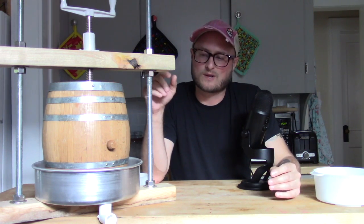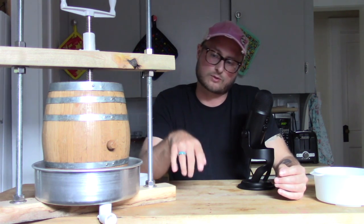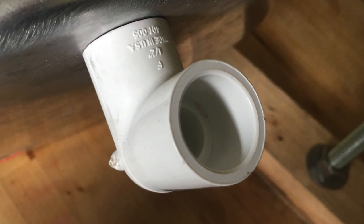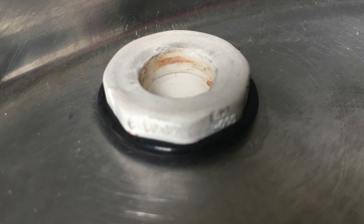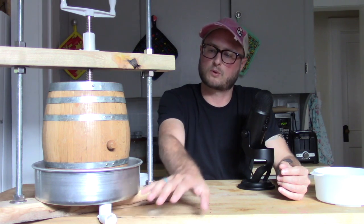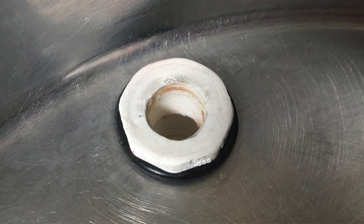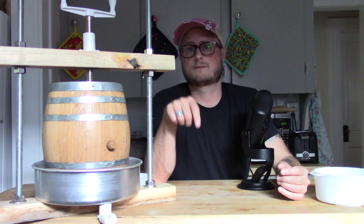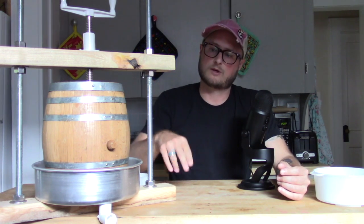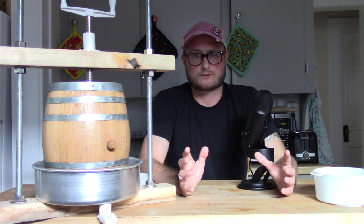With this concept in mind, I went down to the chef's store and picked up a cake tin, then went over to the hardware store and got a PVC 90-degree elbow. This elbow is threaded at the top so you can put a threaded stopper in it. I got the stopper and some O-rings, and used about a 3/4-inch drill bit to bore out a hole, then a Dremel to fit the hole just perfectly for this PVC elbow. I put the stopper in, then used that same Dremel to dremel out the core of the stopper, basically creating a waterproof elbow that hooks into the cake pan. With my Franken-Press assembled, I was ready.